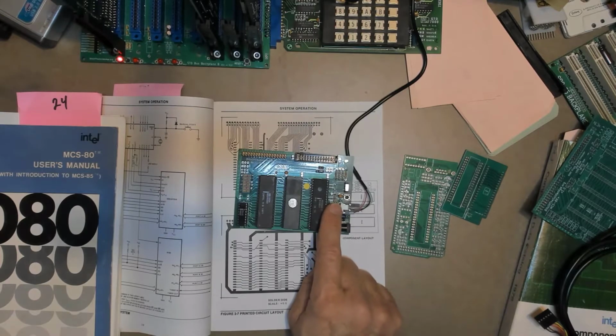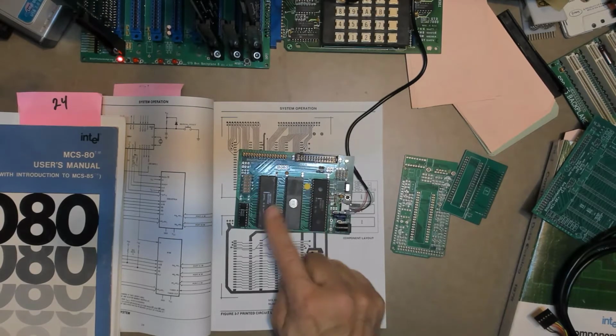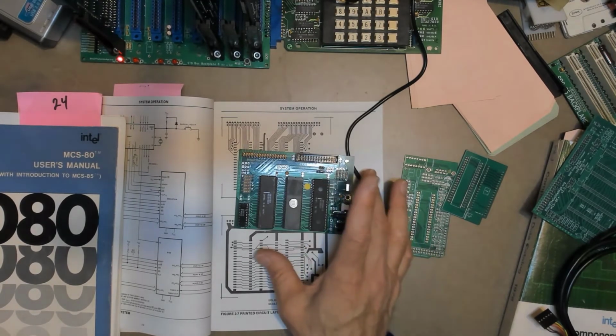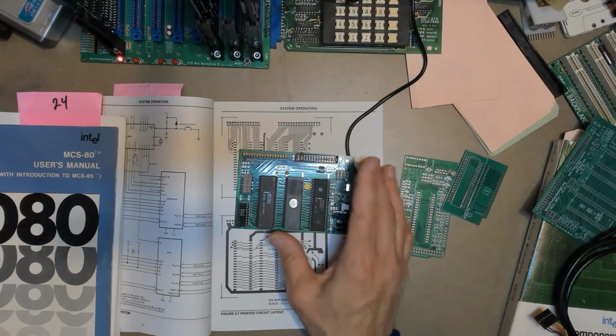So anyway, I'm going to change this from a 3-pin to probably a 6-pin, bring out the power, and a couple of extra jumpers so that you can connect those to something on board if you want, the request to send and the clear to send. And it is really convenient to use this USB instead of having a barrel connector and a little wall wart sitting around. I'm also going to add mounting holes, and I think that's about it for the changes.